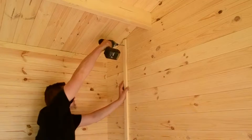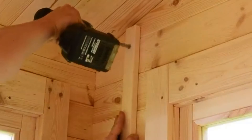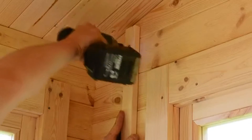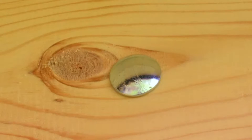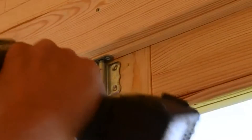When installing the storm bracing, affix them to the top log board and run them down the sides of the cabin. Begin by lining up the bracing and drilling through the cabin wall to insert the bolt. Hand tighten the nut whilst you align the bottom of the bracing. Use a spirit level to make sure it's level. Once the bracing is secured, tighten both bolts with a wrench. Repeat this for all four bracing strips.